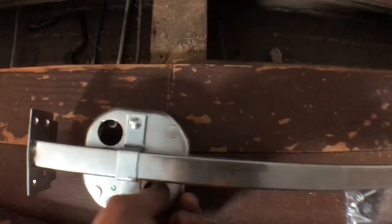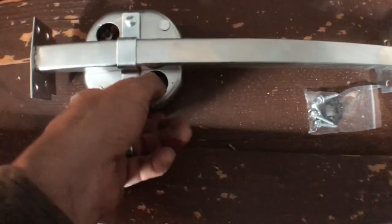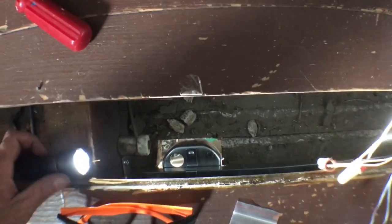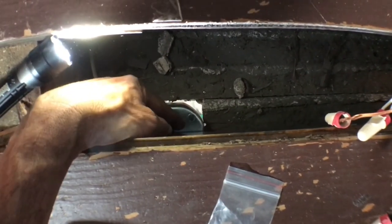To pop these knockouts out, just push your thumb in there — boom, it comes right out. Same with the side ones: push them in with your thumb and you're all set. The box has now been mounted. Let me shine my flashlight in there — there is our ceiling fan box, nice and secure. The only wiggling you hear is from the box itself, which I'm going to secure from down below.